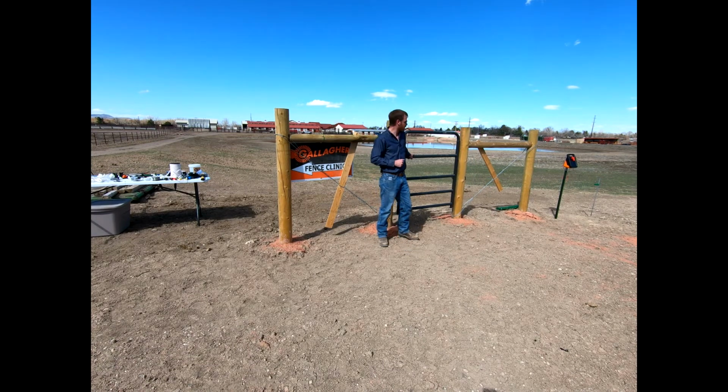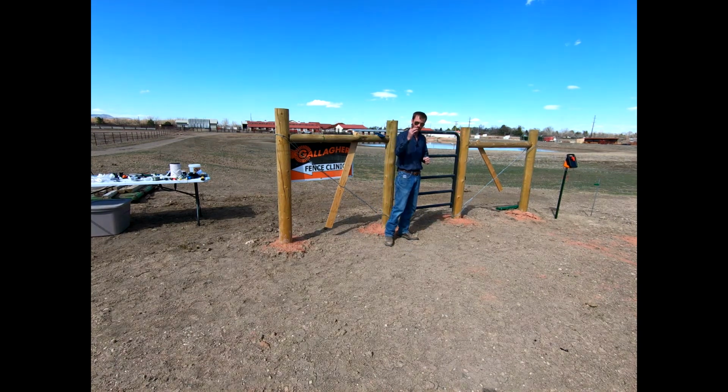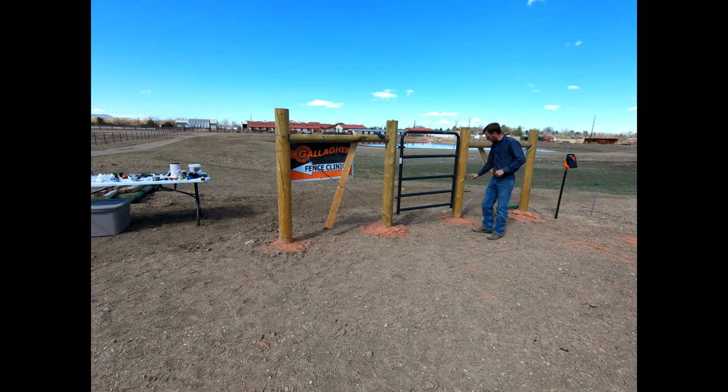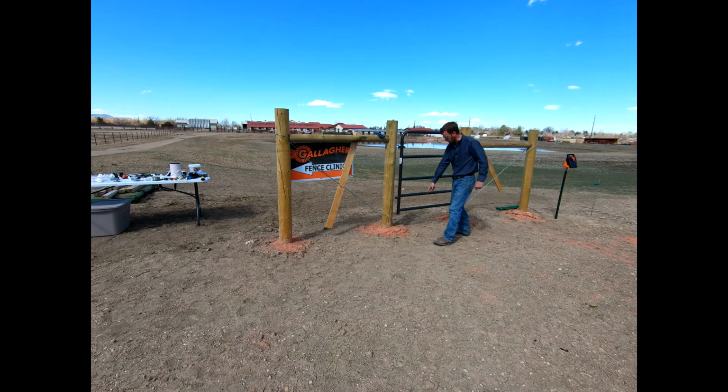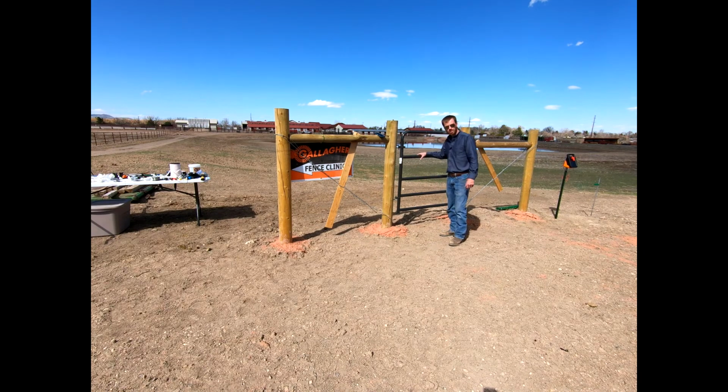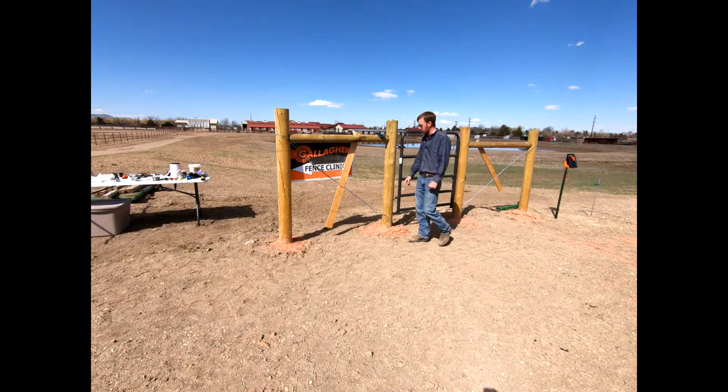So that means we're going to take our insulated wire that you just saw, has that black insulation on it, galvanized wire inside. We're going to run that down, bury that underneath the ground in this gate, run it back up, and then connect it to our fencing system again. Allows us to utilize our traditional gate, and everything is still protected, insulated in the process.